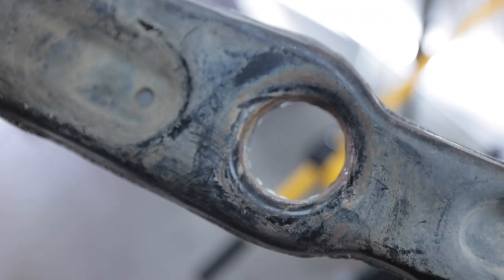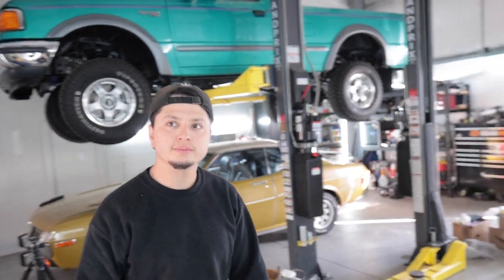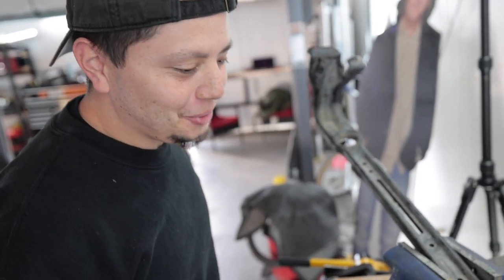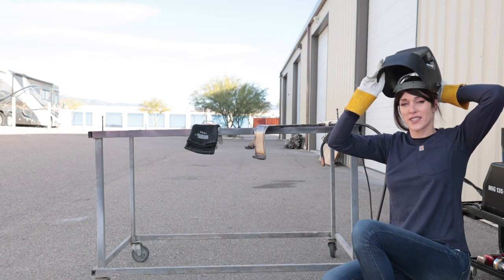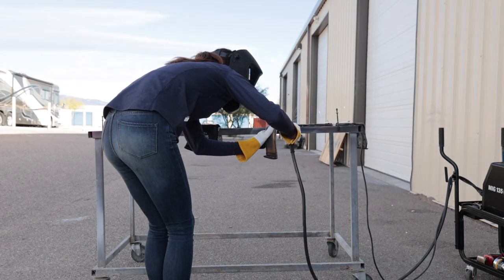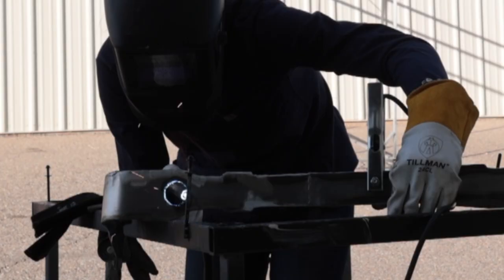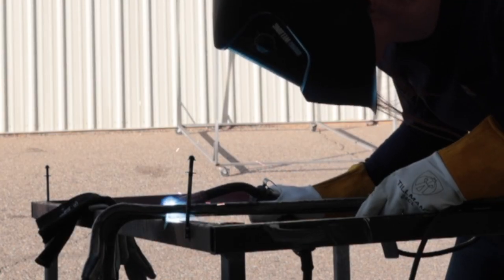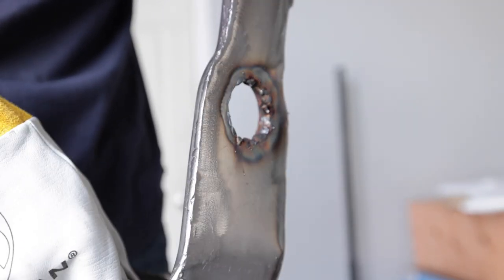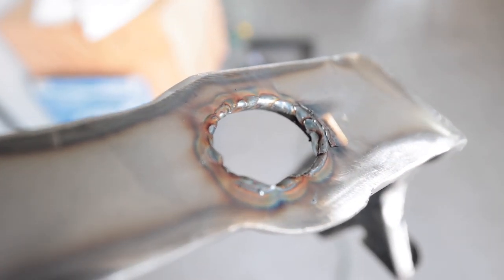Both of these are perfectly weldable donut holes. There's no rubber bushing that goes in this one, so I don't know if I should do it or not. It might add strength. There is absolutely no wind today or even yesterday out here, so it's perfect for welding outdoors. That one was kind of hard because I had about an eighth inch gap between the two pieces of steel that I had to fill. This side the gap was a little smaller, maybe two or three millimeters, and I feel my weld looks a lot better on this side.